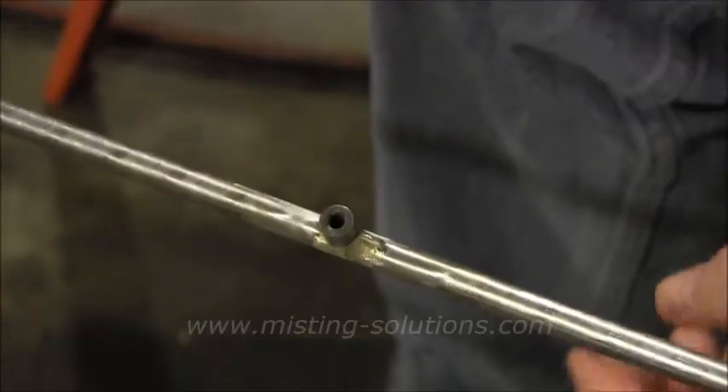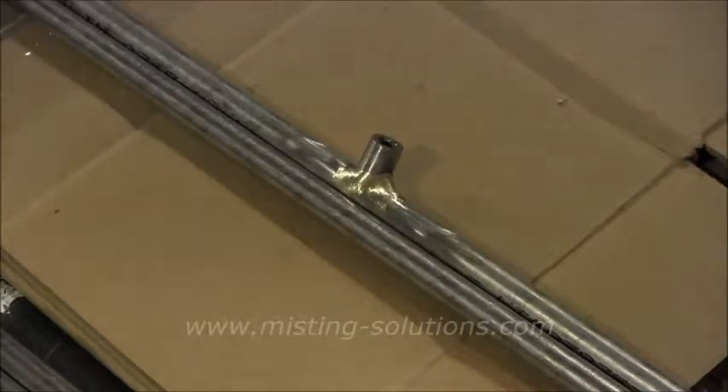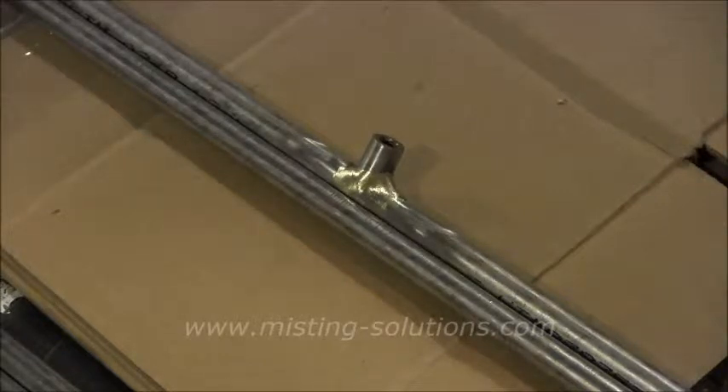What I'm doing here is drilling a hole into this other piece of tubing, lined up with the one that's already brazed on there — drilling a hole right next to it. These are actually 20-foot sections of tubing and I'm putting three of these tube seats on each section, each one 6.6 feet apart, which gives you 3.3 feet at the end to combine the sections together.